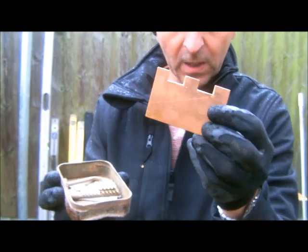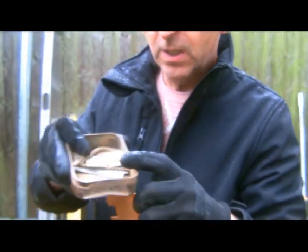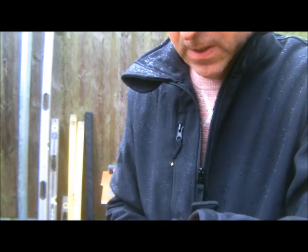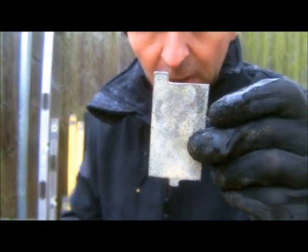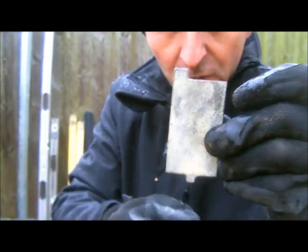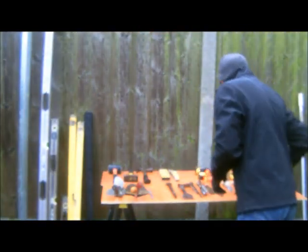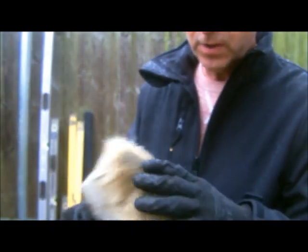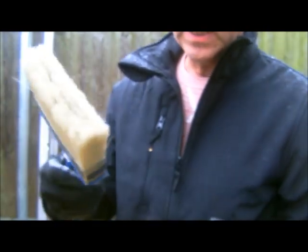I also have my little tin. In my tin I have my tingle — I used to use an old credit card but these copper ones are much much better. Also in there you'll see my additional combs for my comb chisel. There's a video coming shortly where you'll see me using these — this one is for recessed joints on bed joints and this one for internal corners. Always have a brush for finishing off your brickwork, a really soft one.